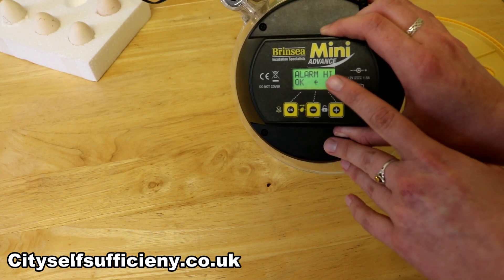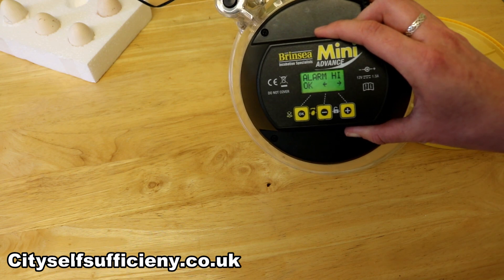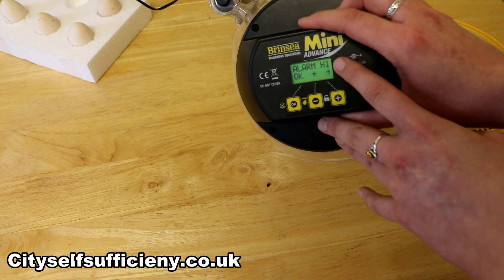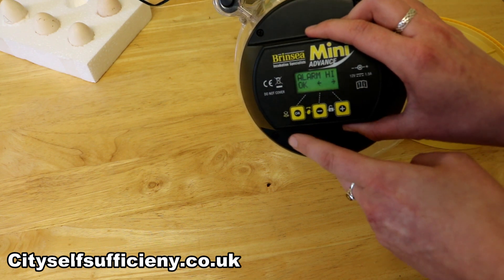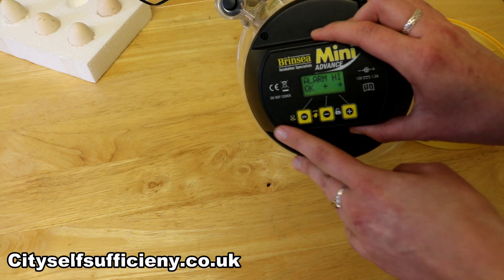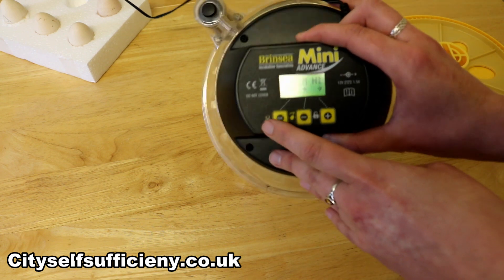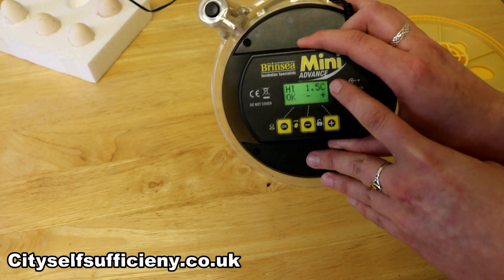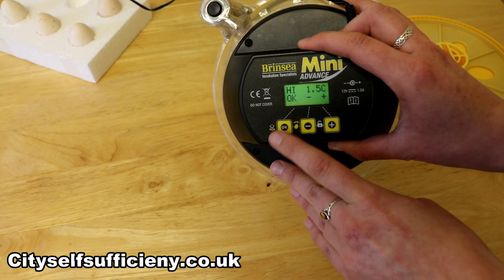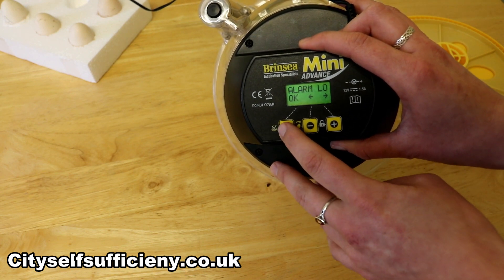Alarms — good brands of incubators like this one have an alarm that goes off whenever the temperature gets too high. If the temperature goes more than one degree above your 37.5, it can damage the embryo inside. Temperature going down can cause the egg to hatch much later, and if it goes up it can kill the embryo. So you need to keep the temperature as stable at 37.5 as you can. I'm setting mine so the alarm goes off if it gets more than 1.5 degrees above or below 37.5.